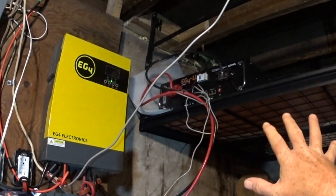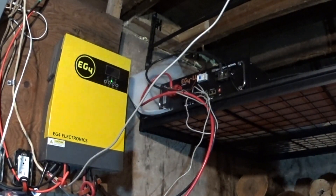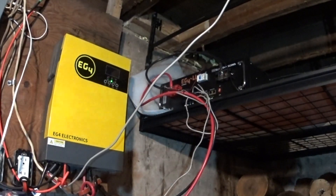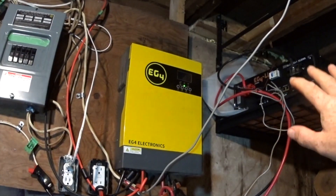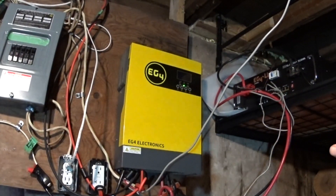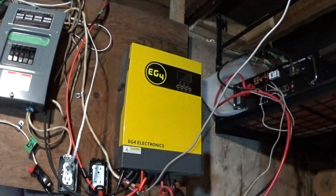Now I do need more battery capacity. The 5 kilowatts isn't ideal — you need to have a sunny day every day for it to keep up. But I will be building a 15 kilowatt battery, which should provide enough storage. A large part of the problem is during the day my 3 kilowatt array will charge the battery up until noon and then it's full — after that, it just maintains the household load, and I don't have any place to put all the extra energy.